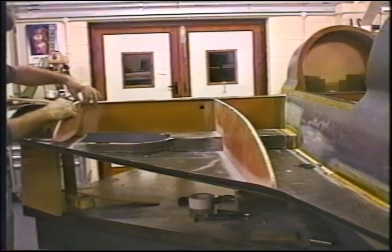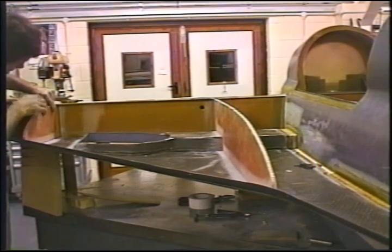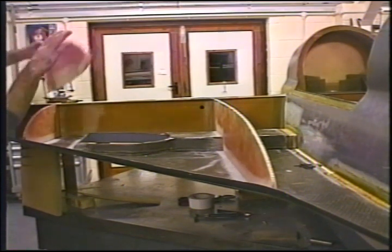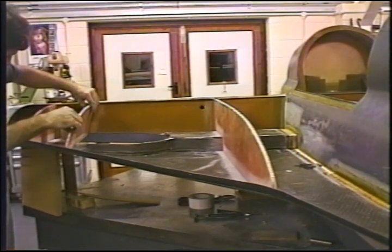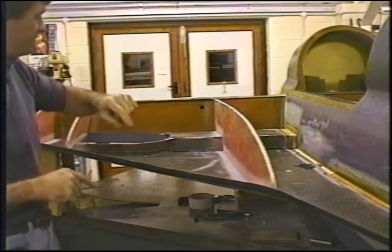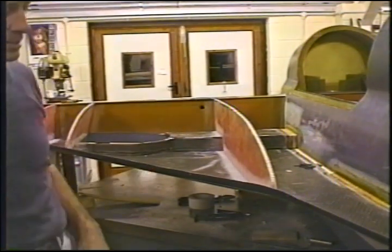This one here obviously won't need that. It'll go in from the edge, squishing in all three interfaces without wiping off the material. This one as well, I believe, can be slid in and squished down without wiping the micro off any surfaces. This one, either create some extra space so it'll come down in, or bevel the edge so you can push the micro in from the other side.